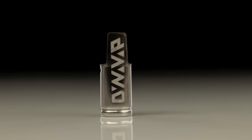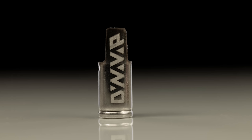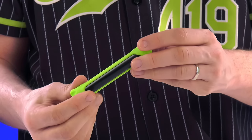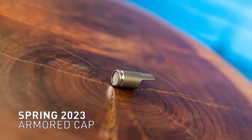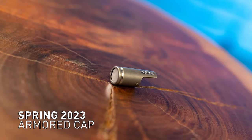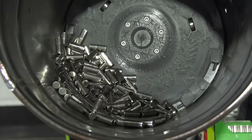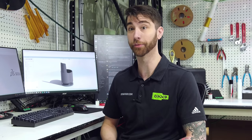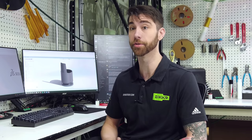In order for this to work, we had to substantially overhaul the cap first and foremost. We're deciding if we want to go with new larger SnapDiscs for a larger cap, or can we find a way to use the original ones on the standard cap. The desire was to make everything backwards compatible, including stashes and different packaging. Instead of adding mass to one of our existing caps by attaching or welding something onto it, maybe we should just machine a cap out of solid material and make it thicker. This kind of got things moving along in terms of the development of the armored cap. Our traditional cap is a deep-drawn unit that we modify — we laser it, put in SnapDiscs, and crimp it.